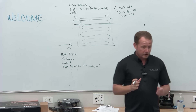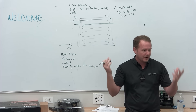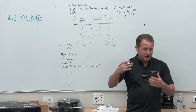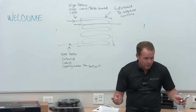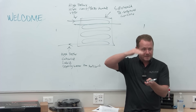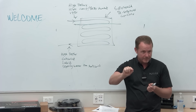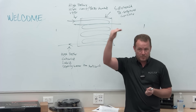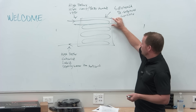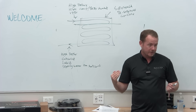If you're looking at your PT chart or your gauge, you look at the pressure on discharge coming out of the compressor. The temperature of the refrigerant is actually higher than what you're seeing on the gauge — that means it's superheated, heated above saturation, which means it's fully vapor. So the first part is to get it to the point where it starts condensing — drop that sensible temperature until it starts to change to a liquid.